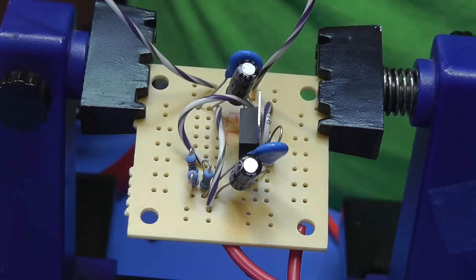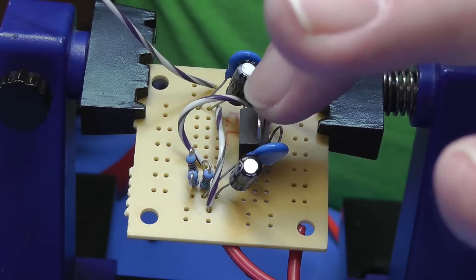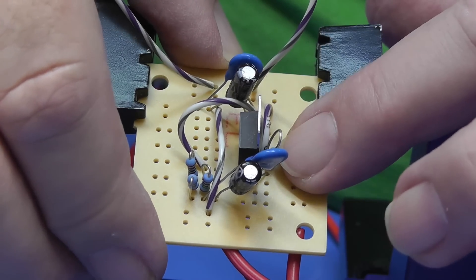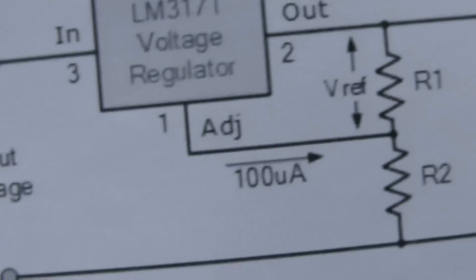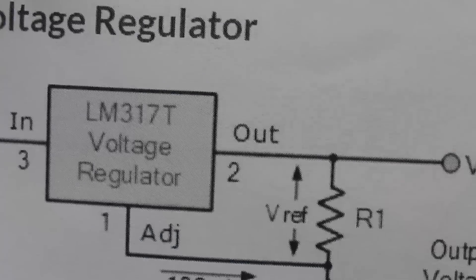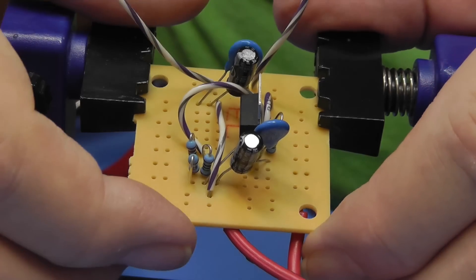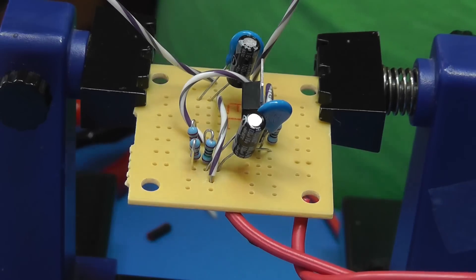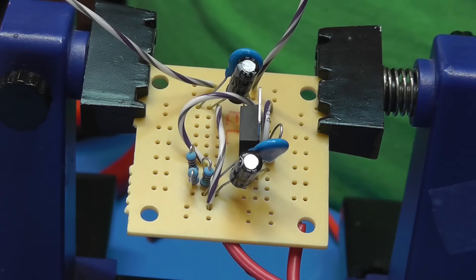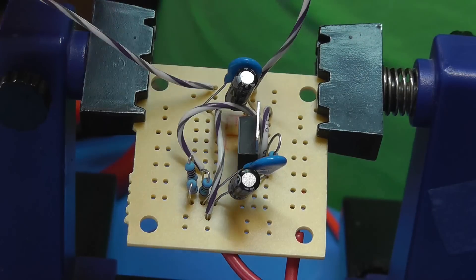And for very high frequency stuff I've got these little capacitors here — that will short that to ground. The electrolytics aren't so good at the higher frequencies. In here you can see the voltage regulator IC. And this is the resistor R1 right here on the diagram. R1 and R2 is this composite of three resistors. And then I have little jumpers to get everything hooked up. This is a classic case of breadboarding where you end up with jumpers. If I'd really thought about it, maybe I would have had a better layout.